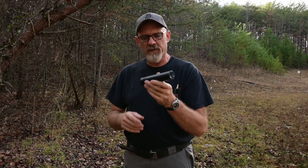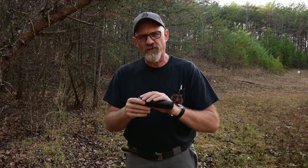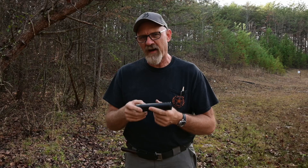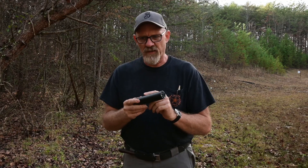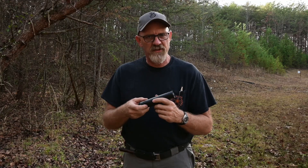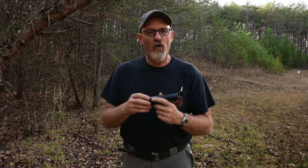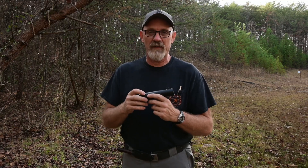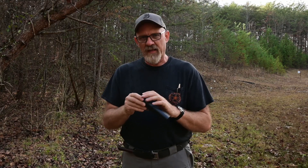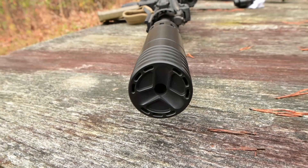Now that I've set aside the carbine, I can talk about the suppressor a bit more. The exterior of the suppressor module is made of Grade 9 titanium, and the core assembly is made of Grade 5 titanium — it's all basically one homogeneous piece. We didn't do any weldments in there. You do have a fully supported blast chamber, indicative of all our other designs, and it has a large, long-life Inconel blast baffle insert that is mechanically retained inside the baffles.